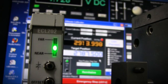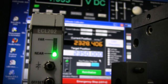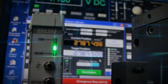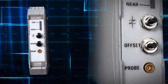A useful multicolor range indicator tells the user if the probe is in, out, or near the end of its calibrated range. The indicator is independent of the output voltage so that adjustments to offset do not create uncalibrated measurements that appear to be in range. For ultimate performance in an eddy current displacement sensor, the ECL202 is what you're looking for.